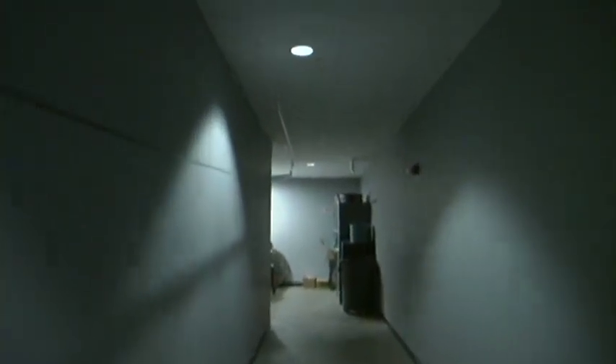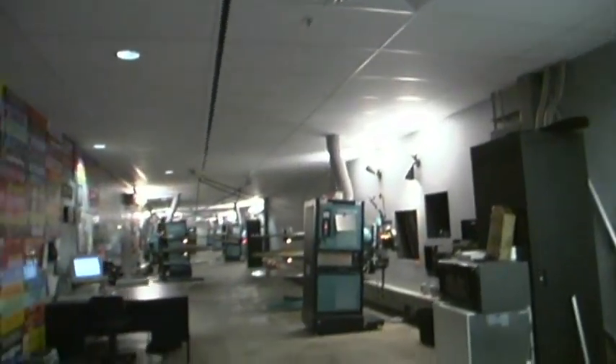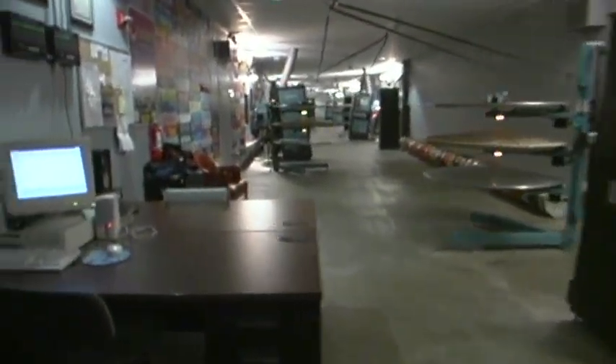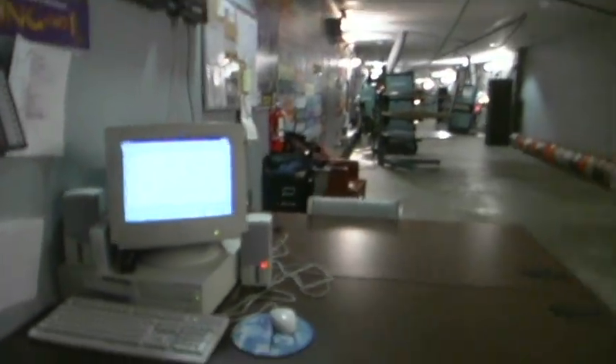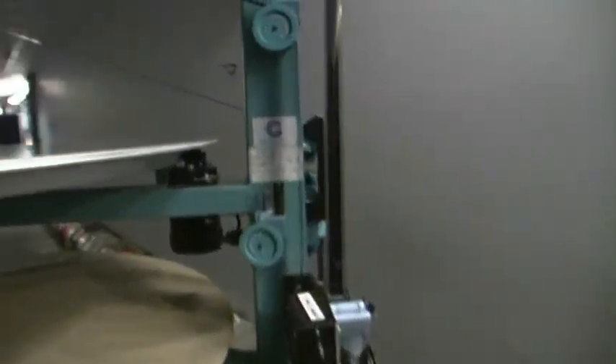We now arrive back at the third makeup table where additional rollers will redirect the film into the fourth booth. Earlier it was mentioned that this theater has no functioning interlock circuitry. This is due to the fact that only select pairs of projectors were hardwired together during the initial installation of this theater complex. Later the CA-Link computer software program was added, but due to the existing wiring in this booth, the computerized interlock control does not work. Although the status panels demonstrated that each projector started at slightly different times, this close-up shot of the interlock screen, which does not display any links, provides further proof that the CA-Link is not being used to drive this interlock. Here the film runs through number 15 and starts making its way through the fourth booth, counting down to its final resting place on the left, number 9.